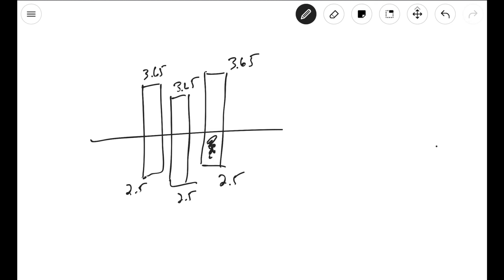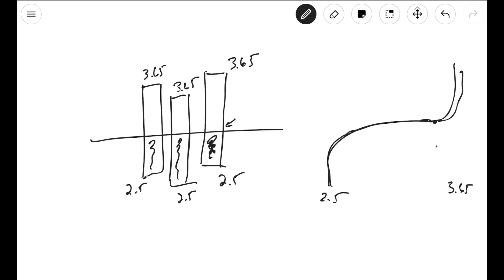So the cells are charged up to here, and this is what we observe. We observe whatever this voltage is. The important thing to keep in mind is that lithium iron phosphate has an extremely flat voltage curve. At the very beginning, you go up really fast to around 3.2 volts, then you hang out between 3.2 and 3.4 volts for a really long time, and then the voltage spikes when you're filling up from that last 90 to 100 percent.